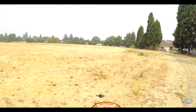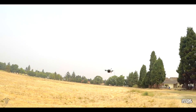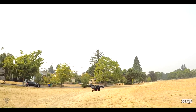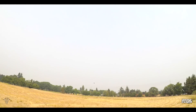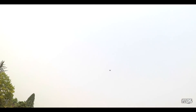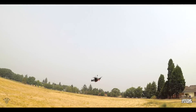Let's go ahead and get it off the ground. You guys can build this quad any way you want for any type of different application — you can do it for long range. This is what I have it set up for: a long range application. Even on a 4S 1300, I'm getting well over 5 minutes flight time. On a 1500, I'm running into like 8 minutes. So if you want to put a TBS Crossfire on here and do some long range up the mountain, down the mountain type of stuff, this is the way to set it up. I'll show you a little bit more about that later.